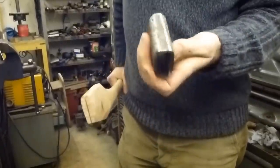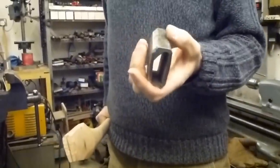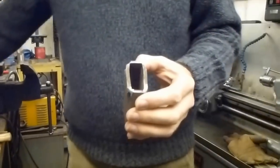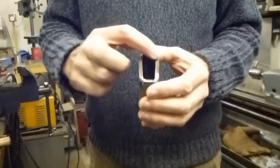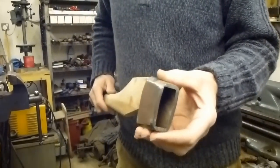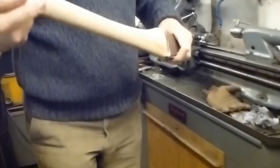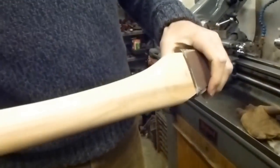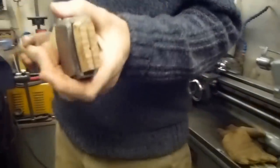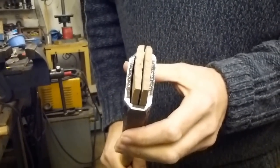My first attempt was to bend this steel by heating it, but I just didn't have the facilities to get it hot enough. So I've ended up welding the whole thing, more or less a rectangular shape, but I was able to cold bend the sides slightly to make it fit better. The whole thing fits quite nicely — it's fitting nice and closely all the way around, and by the time I wedge that it will be very tight in there as well.